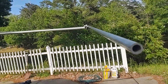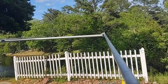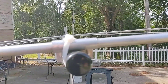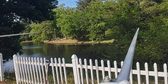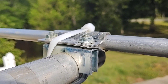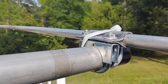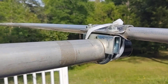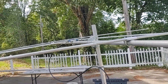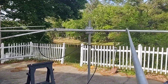This is actually three-quarter inch diameter tubing, 125 thousandths wall thickness. The boom is one-and-a-half inch aluminum, I think it's one-eighth inch wall thickness. There's an end cap on here secured by some Mako five-eighths tubing clamps and a heavy duty zip tie. I actually had to widen those clamps because the three-quarter tubing didn't fit perfect — that was a little bit of work. You also have the saddle u-bolts. That's your one-and-a-half inch boom at 14 feet 8 inches.